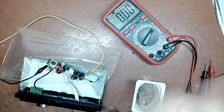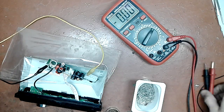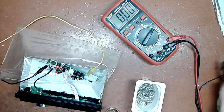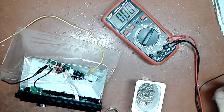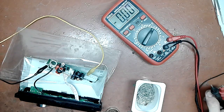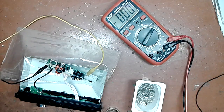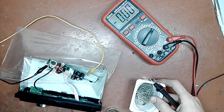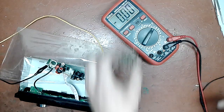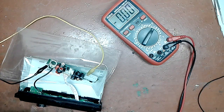And this chip is a dual channel amplifier. The schematic is very simple. Pin 3 of it is supposed to be half a regulator, the output of which is set to half the supply rail. That's essentially a virtual ground point for the inverting input of the amplifier.